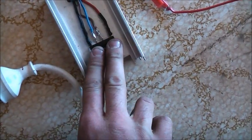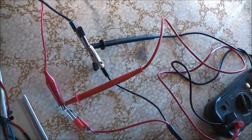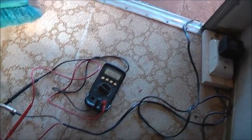Do some checks. Yeah, it's getting hot but not stupid hot — it's only half loaded. Check the ballast, yeah it's working alright. It's holding another 12 volts. It's not filtered, so you don't want it filtered — you want to get as much ripple into that battery as you can. The 100 Hz ripple is actually pulsing and shaking the lead sulfate off the plates.